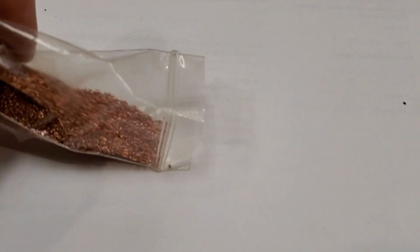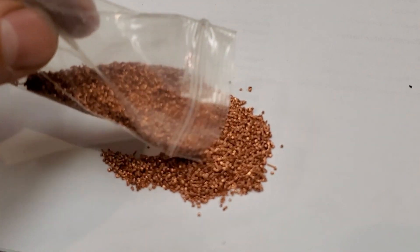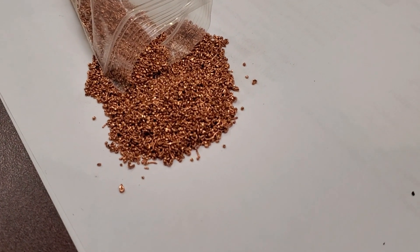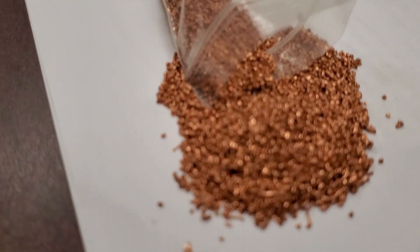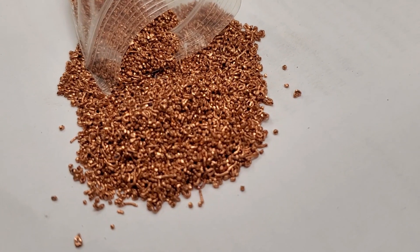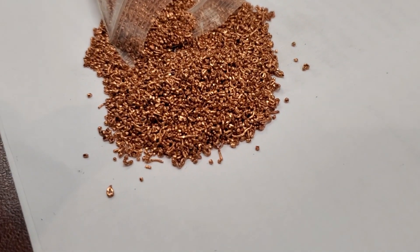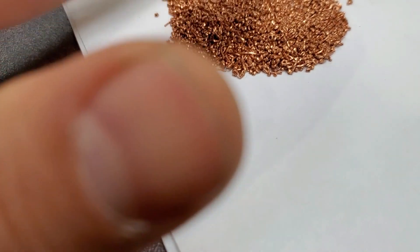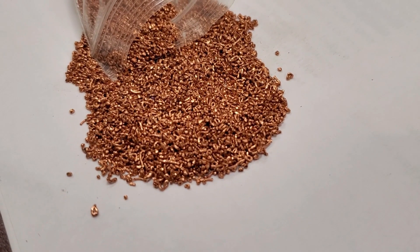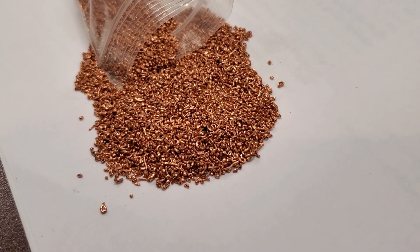Compare that to this — copper from a turbo mill. This was run through one granulator with a larger screen and then through the turbo mill. You can see everything is rolled into a little ball. The process is so violent it just rolls the material on itself and pulls the insulation right off. The biggest difference is going to be throughput per hour. Running it this way also makes a denser chop.